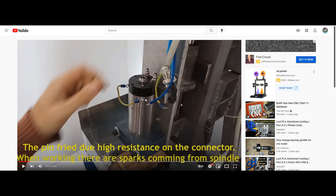We don't know how deep this is, but overall, I want to just disclose exactly how easy this is to ground your spindle. We see the remaining chassis of this unit that the spindle is mounted to is metal. We see that it's non-anodized. And why I say non-anodized is anodization itself is a non-conductive coating. Okay, so any surface that's anodized but metal is non-conductive.